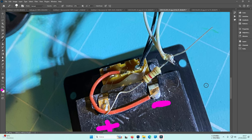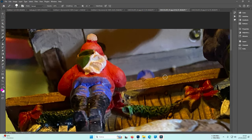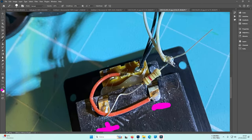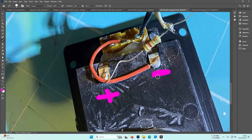But this was useless. It means that the LEDs from the boot work at 3 volts. Maybe they are whitish or bluish and not green and other colors, but this resistor is brown, red, gold, and not the opposite one, because the first band can never be gold. So I know that brown, red, gold corresponds to 1.2 ohms. Ridiculous. So what should be done here?